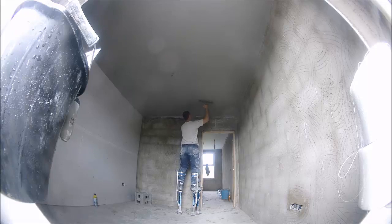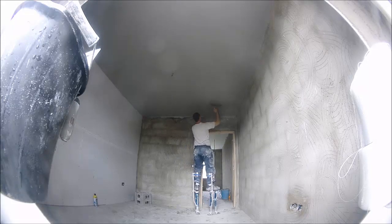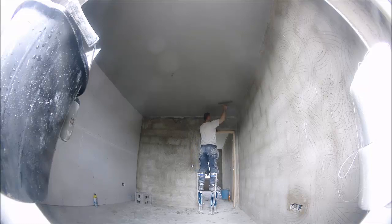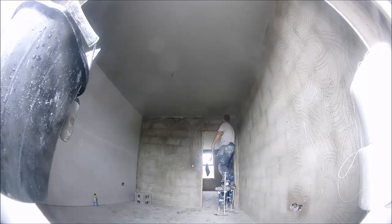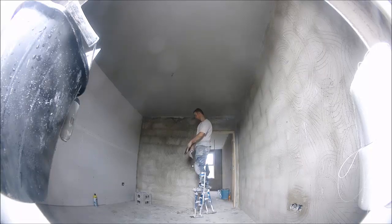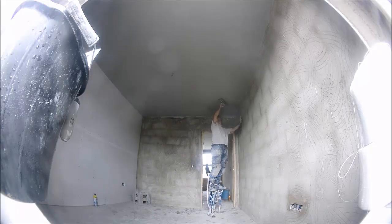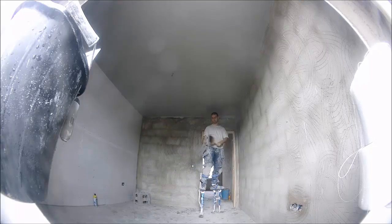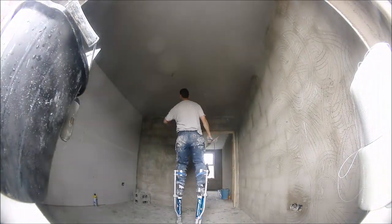Back to the plastering — go back to where you first started your coating. What I do is pull a wee back line, pulling it out from the corner maybe three to four feet. What you're doing now is ironing it in, flattening out any lanes and filling in any wee holes. Even with this trowel I'm trying to mimic a finished ceiling so that if it starts to tighten, it won't take me long to get round and finish it off. The tidier you get it the easier it will be.